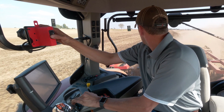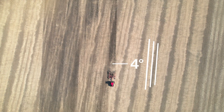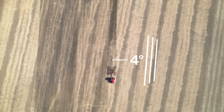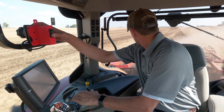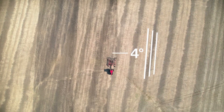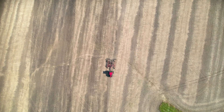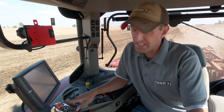I'm going to shallow it up a little bit more to 4 — kind of cruise. We're going about 8.5 miles an hour here. I'm looking just for some light cutting and mixing of residue. The next setting will be obviously zero, so we can take those blades and straighten them all the way up, and really just only looking to cut and mix that residue up.